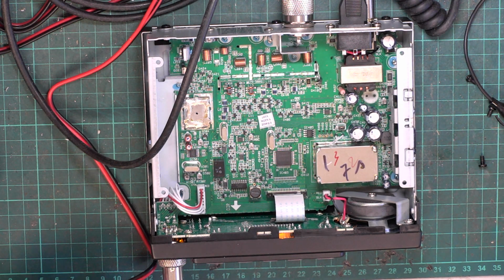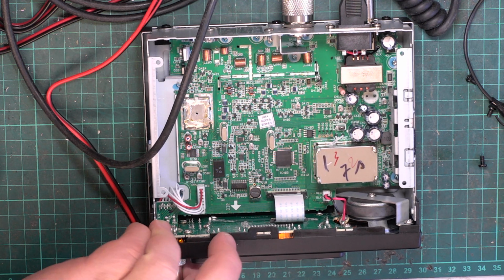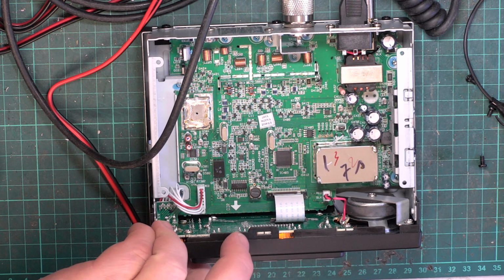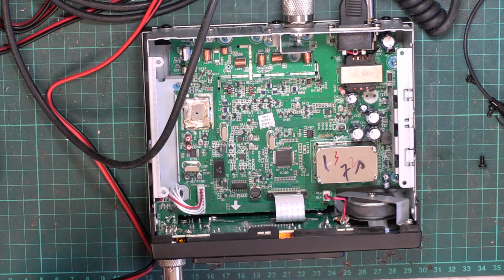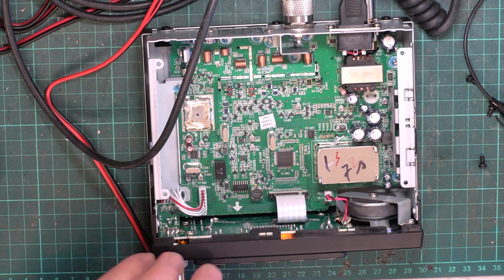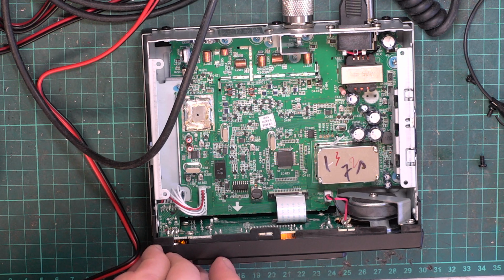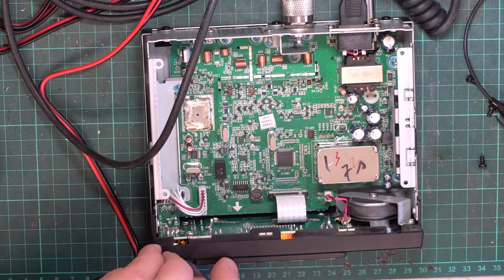So let's see where the auto Squelch is. Really needs to be around between 1 and 3 microvolts. So we're at 0.3, 1, 3. Yeah, that's fine. And that comes in at 3 and drops off at 0.8 of a microvolt. So it's got a useful range, what we call hysteresis.